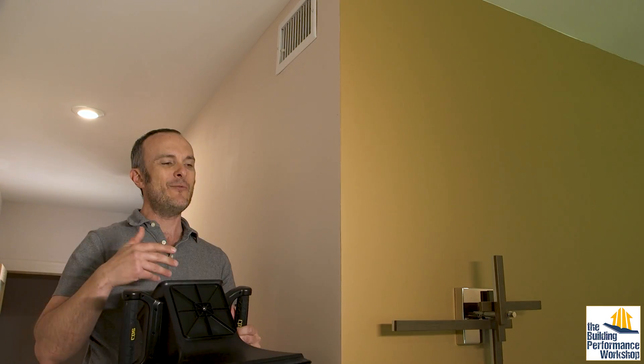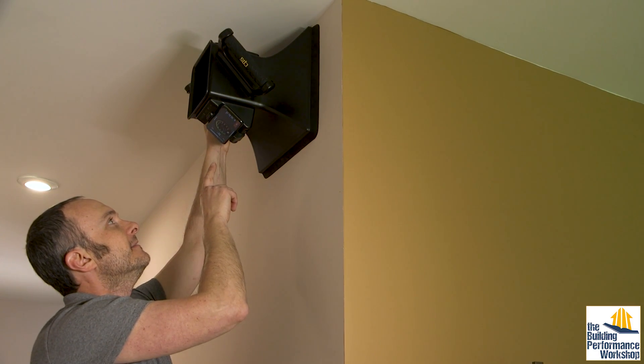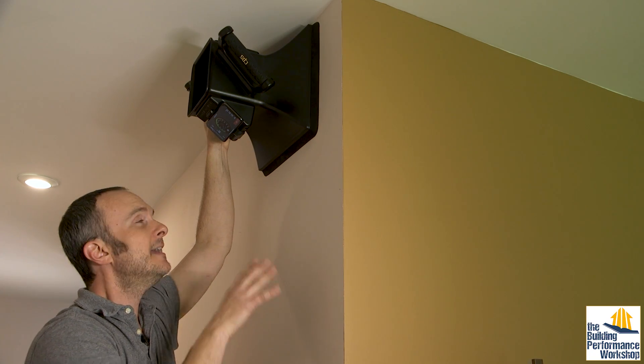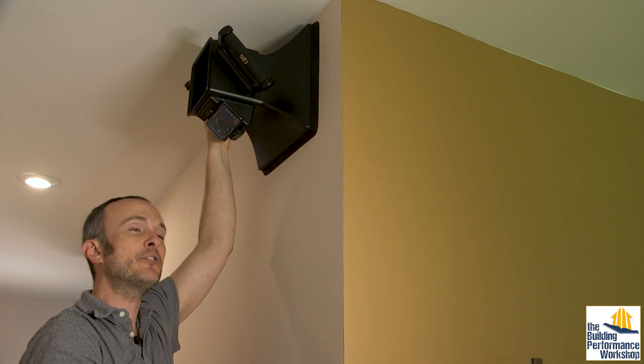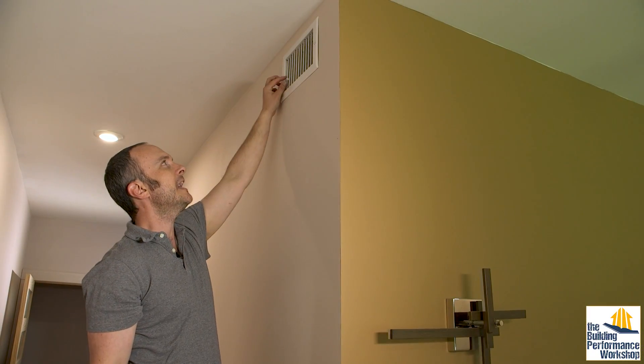As long as you've got dampers everywhere, you adjust the dampers on the branch ducts and the dampers built in at the terminals where the vents come out of the wall, to make sure all the flows line up with what you wanted — which is why you did the planning so deeply in the first place. Since this is a bedroom, I want no more than about 20 CFM coming out of this supply. I can see I've got a little over 60 coming out — that is way too high. I'm going to dial this down using the damper at the face here and the one down in the crawl space, starting with the crawl space one and then fine-tuning with this one.